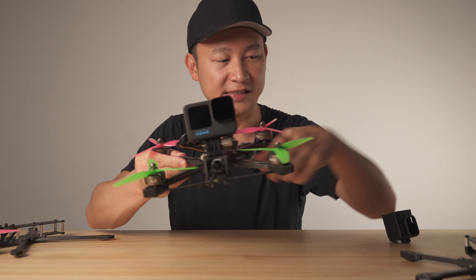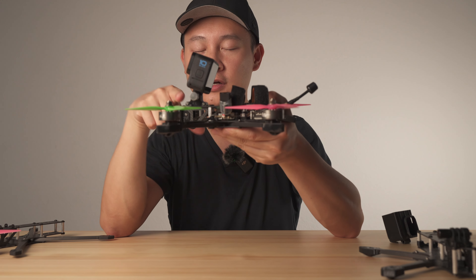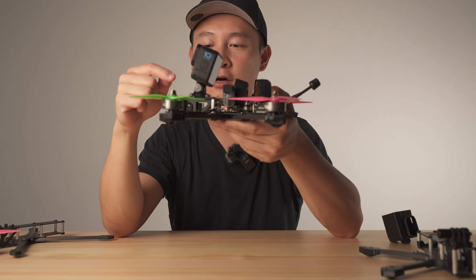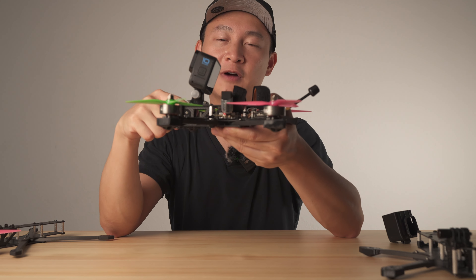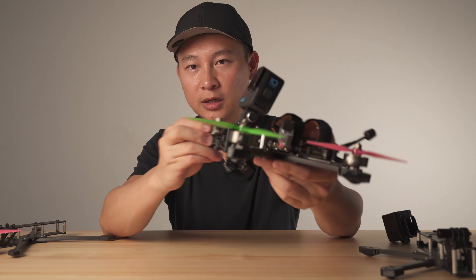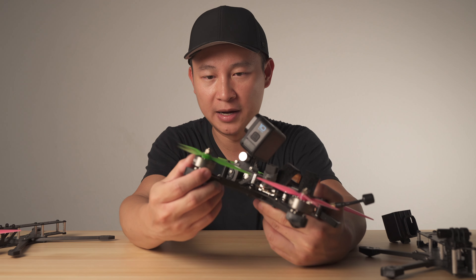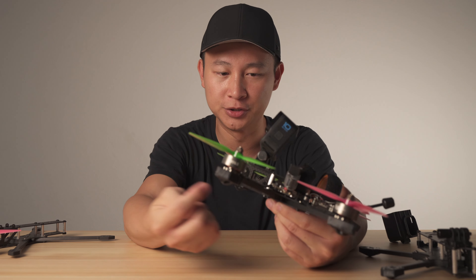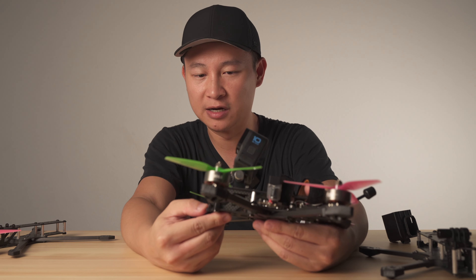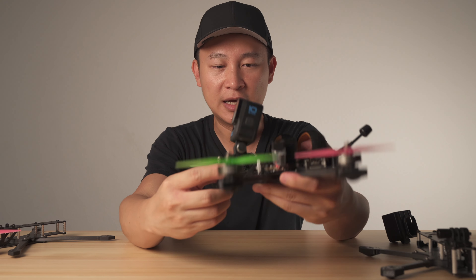This is revision B and this is revision A. On revision B, we moved the camera plate backward a little bit, and the shape is also different. The camera mount is no longer on the carbon fiber plate — we made the camera mount on a 3D printed part so it can help absorb vibrations created by the propellers and transferred from the motor to the whole body. Based on test results, we feel revision B is better.